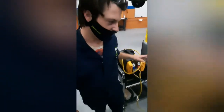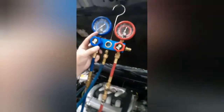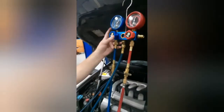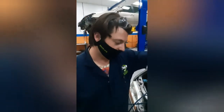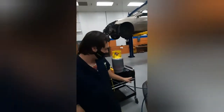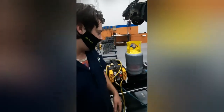After that you can go ahead and purge these lines. Once you've done adding all of your refrigerant, or if you're pulling out your refrigerant, check to see if it's still holding pressure. Once you're done with that you can go ahead and finish up. Purge the lines one more time to make sure you don't have any contaminants left in your lines. Make sure that this is clear, take your last reading so you know what's left in your canister, and you're good to go.